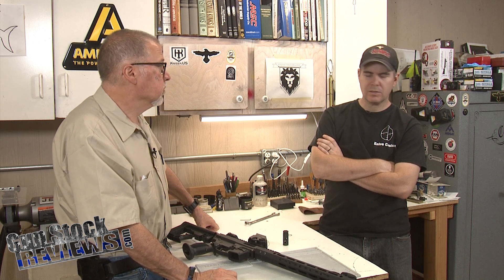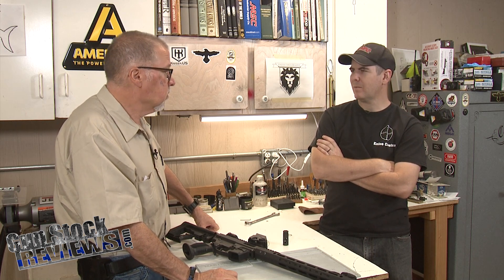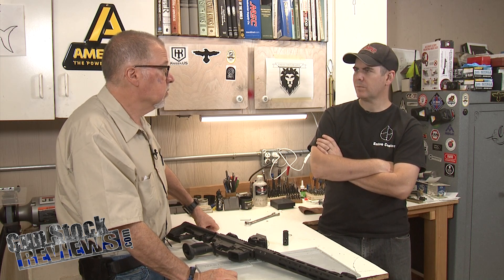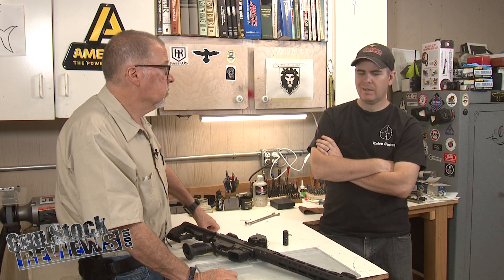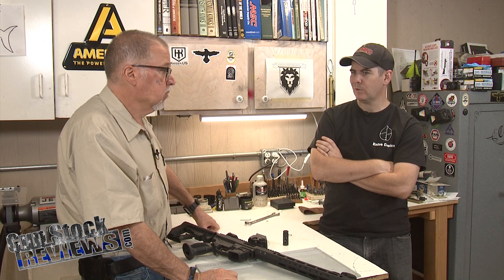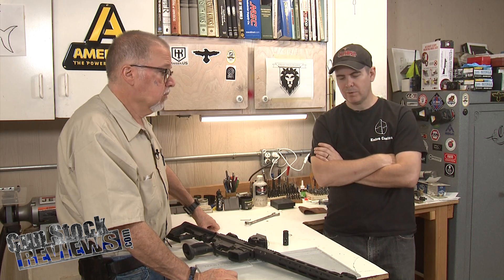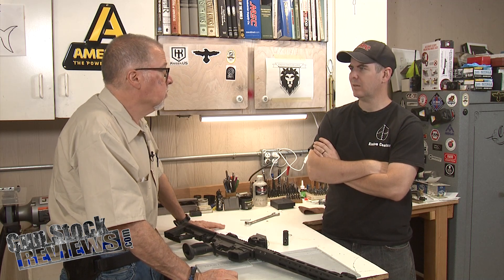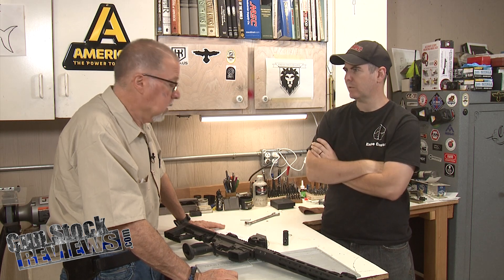Also, just through shooting, it would erode more quickly. You don't really see muzzle brakes wear out that much — M14s were kind of known for having their flash suppressors break through erosion. I haven't run that many aluminum brakes, so I couldn't say definitively what the issues could or couldn't be. With AR-15s, they can occasionally run into thermal expansion issues with aluminum gas blocks where, if they're not set tight, they can start to shift.